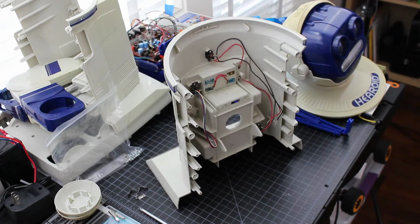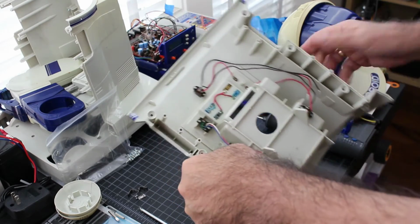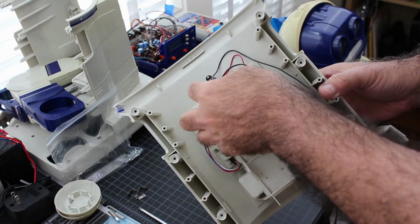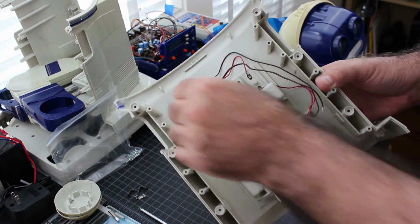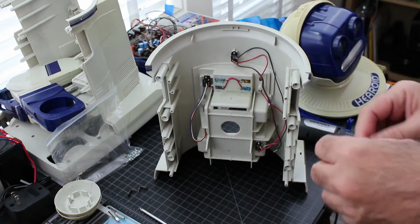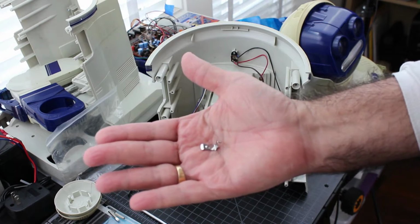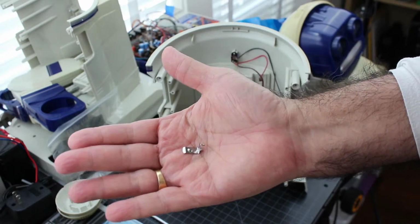Okay, so I'm going to look at fixing these. There's 3 of these terminals here that are pretty gone. They're pretty corroded. Not only that, one of these wires has corroded itself right off of the pad as well. So what we're going to do is replace those. Instead of making copper terminals, we're going to replace them with these battery clips. These battery clips I got from a place called Newark. I'll leave the link below.